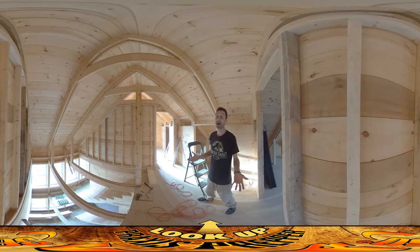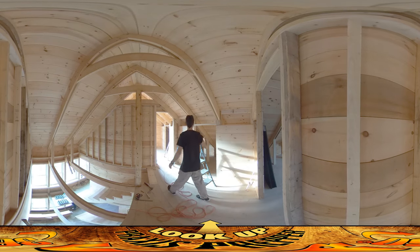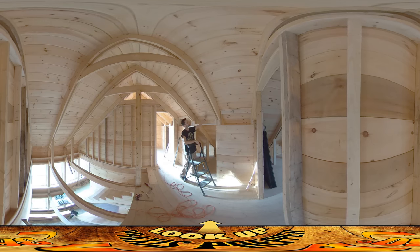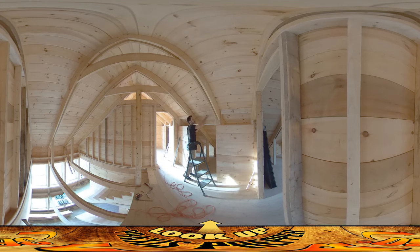What I've been working on today is finishing all these closet walls — again, trying to use up as many of the boards as we have downstairs. I created these extra nailer areas where the boards are going to come up and over. I realized just a moment ago that I need an extra board up at the top of these, just like I have up here, so that the last board can nail in. It just slipped my mind. I'll just toenail it in — it would have been easier to fit it in earlier, but I'll just throw it in.